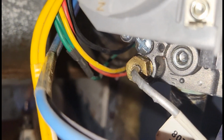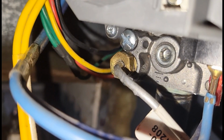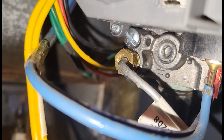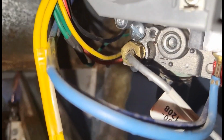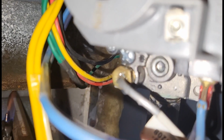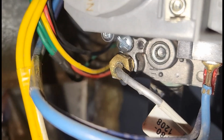Because like I said, if you had a bad leak, guys, you'll have bubbles instantly. But what's weird is that some gas leaks, it does take a few seconds to form. So when in doubt, always hit the joint over. Like I said, guys, there's no shame in hitting these joints 2 or 3 times, especially if you got a busy day. You definitely don't want to overlook something, and now you got to come back here again to do this for a second time on a recall.